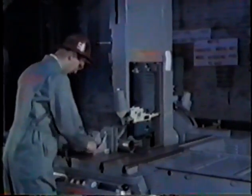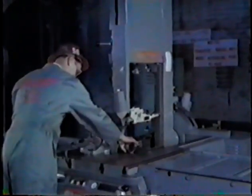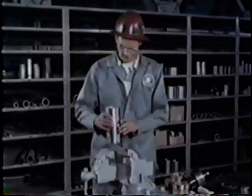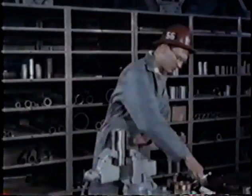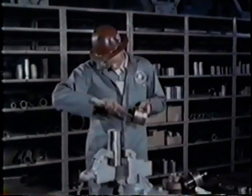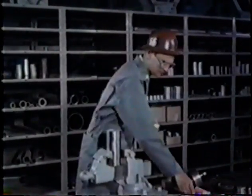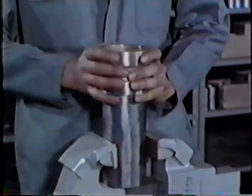When cutting the pipe, remember that a square cut is essential for the pipe to seat properly in the fitting. Use a ream or file to remove burrs. Check it and file it if necessary. Remove any nicks or ridges from the face of the socket that would prevent a good fit or reduce capillary action of the alloy. Do not chamfer the fitting. Try the fit.